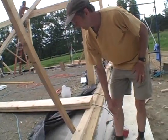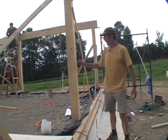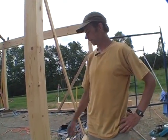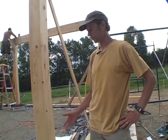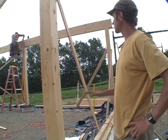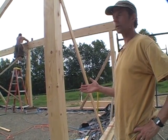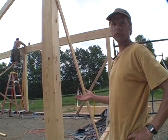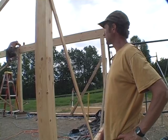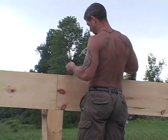The timbers here are locally sawn and planed white pine, a native species that came from about 15 miles away. It's a very simple timber frame — we're not doing traditional joinery. We're using basically bolts and plates to hold it together, which saves time but it will still look really nice, and it is the structure of the building.